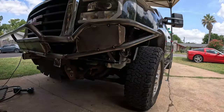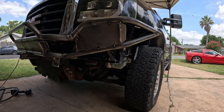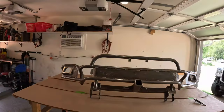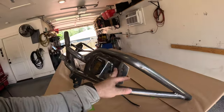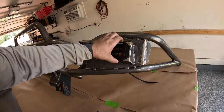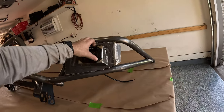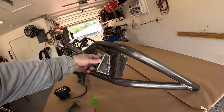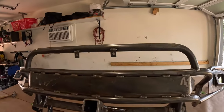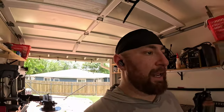We've got space for airflow and protection. I'm going to build something to cover up that tank because it definitely looks like it's going to get destroyed, but that'll stay on the truck separately. We've added fog light pods — I wanted the fog lights to generally point forward, down, and out so they're actually useful. I got some yellow-type fogs that come with a gasket and bolts — we'll drill the holes after painting. I fabricated a little 1/8-inch plate box for these. I also added some tabs for the license plate. Checked all the welds and cleaned everything up — just about ready to paint.